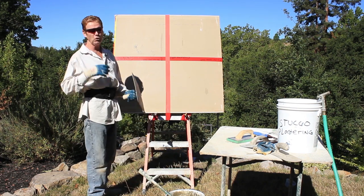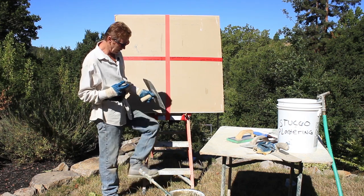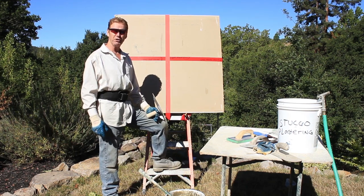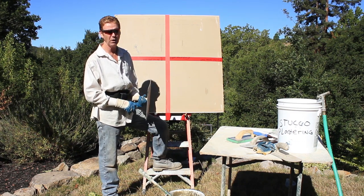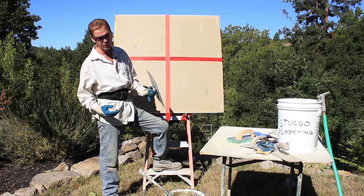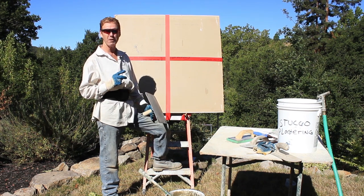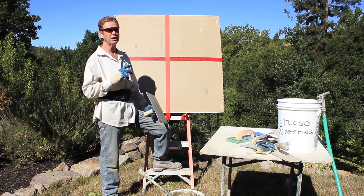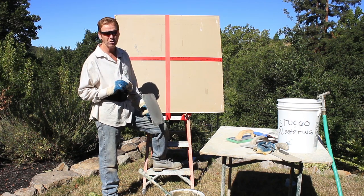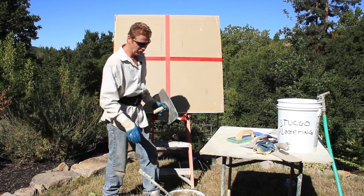What I'm going to do here is a two-coat system, a scratch and a brown. They said, I want it smooth. I said, how smooth do you want it? Do you want a scratch and a brown and let it cure and do a Santa Barbara or BMI marble finish, or a smooth finish, or do you want a two-coat system? He says, I want a two-coat system, we're going to paint it, and I want it as smooth as you can get the two-coat. So I thought I'd show you folks how smooth we can get the two-coats - some do's and don'ts.